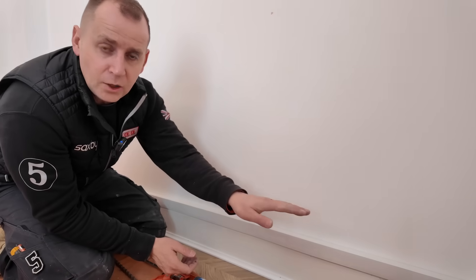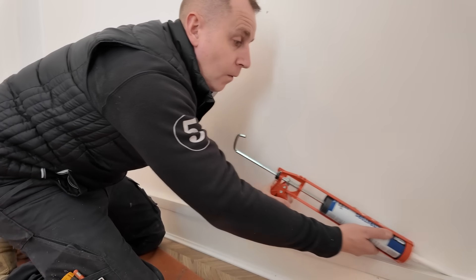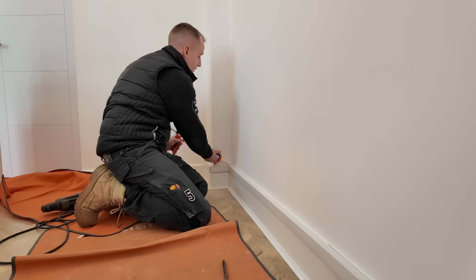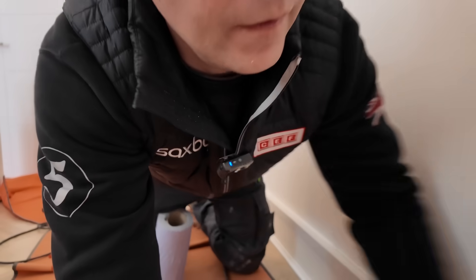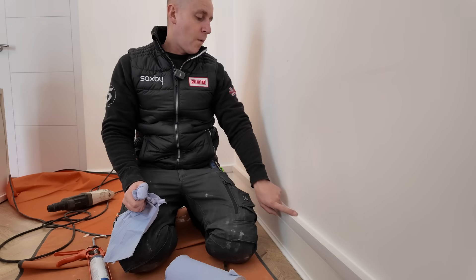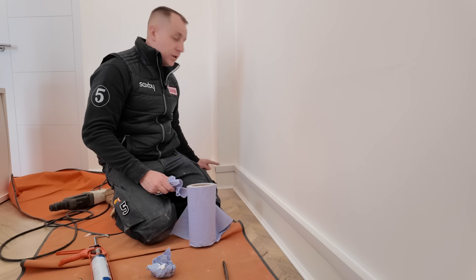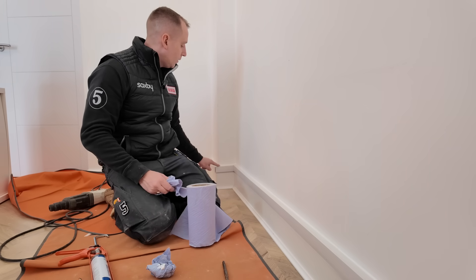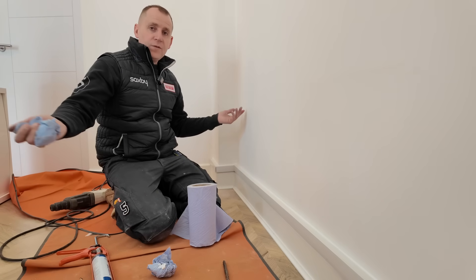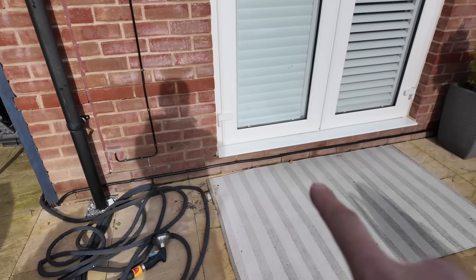When you're caulking up the trunking, try and go as far along as you can in one go and keep it nice and quick — you'll get a nice clean finish. Then just get a bit of tissue and pick up the excess, and you end up with a lovely bead. It just finishes off the trunking work when you've got to do it. I just use any excess to fill any of the little holes where the cuts aren't quite perfect — none of these walls are square at all. Obviously, there's the charger, just finished my testing, and this is how the job looks — EV Ultra clipped underneath there.